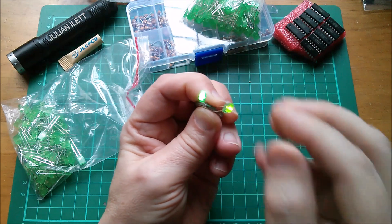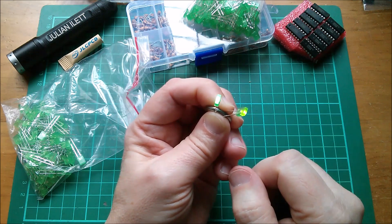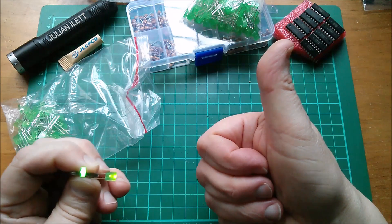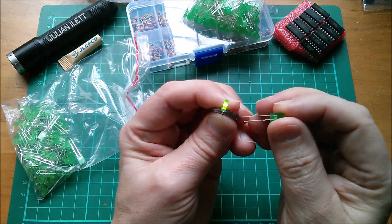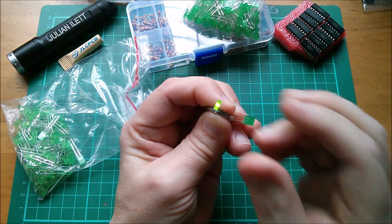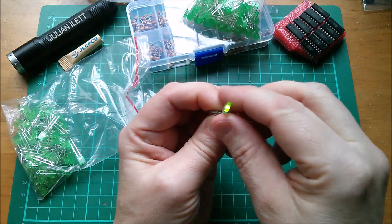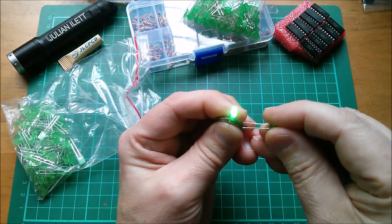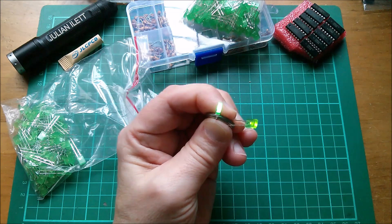This one's not very bright at all. I think I've got my dim green rectangular LEDs, which is what I wanted — thumbs up! These are definitely the dim LEDs. Look at the brightness of this one — when I put the high-brightness one on it doesn't change at all, but it's pulling the brightness of the high-brightness one, which has a higher forward voltage, way way down. Check out the mega brightness of the bright one, then watch it dim when I attach the other one across it, because it has a lower forward voltage.